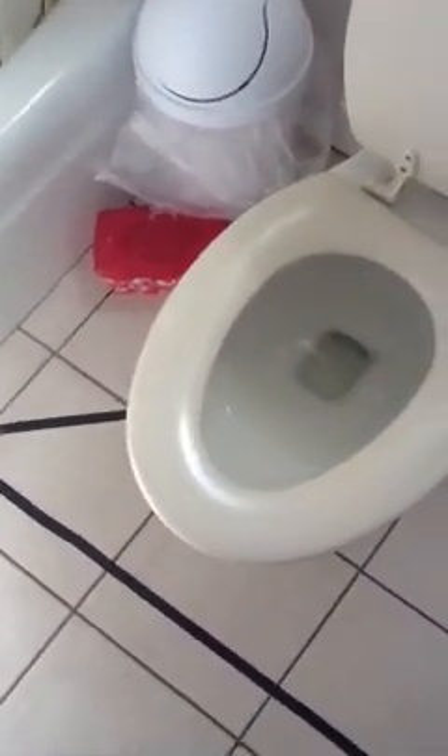This Y goes from the toilet, and the lab sink also hooks into this Y. We can pull that water closet up and remotely reinstate that with about a 95% chance of a good smooth remote reinstatement. But if we do have to break in front for that Y, we would probably replace both Ys right here when we do the liner.